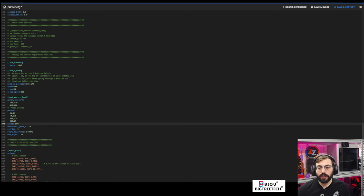I forgot heat sets — I can install those after the fact. Always do your heat sets before you install parts in your printer; makes it a little easier. In terms of Trident versus 2.4, I like them both and don't really see a difference in performance. But I kind of like how the 2.4 has a fixed bed — all your parts are fixed to the frame. If you need to remove a part you can just yank on it without worrying about the bed moving. It's nice to have the part not move at all; it's easier to see if there are issues, especially with Z-hop. I think it's better for time lapses too.